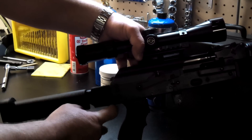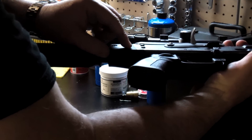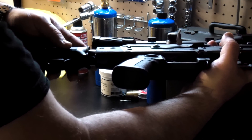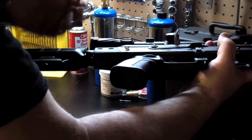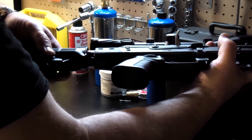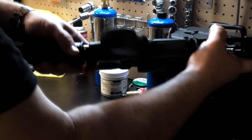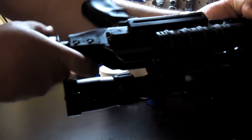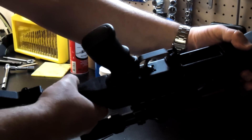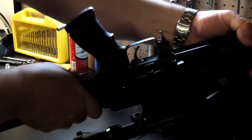What I did is I just filled that void with epoxy — black epoxy. To make black epoxy you just need to mix the epoxy and spray some black paint in it. It doesn't have to be completely black because everything else is black, so it will look black. It actually looks fine — it depends on your level of perfectionism how good you want it to look; you can make it look even better.